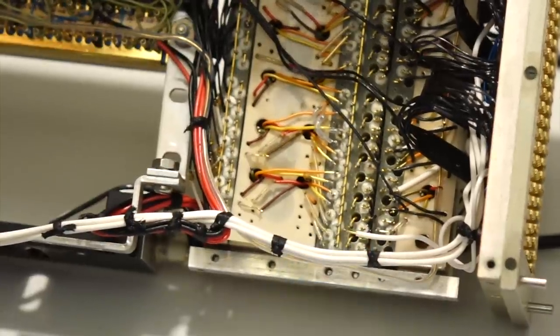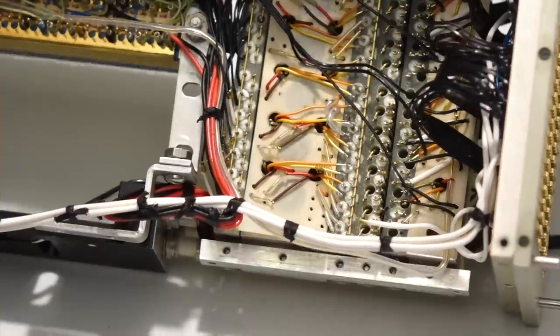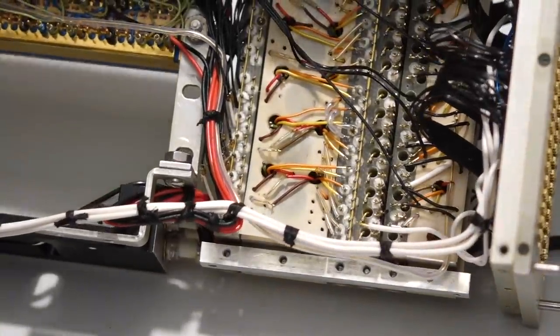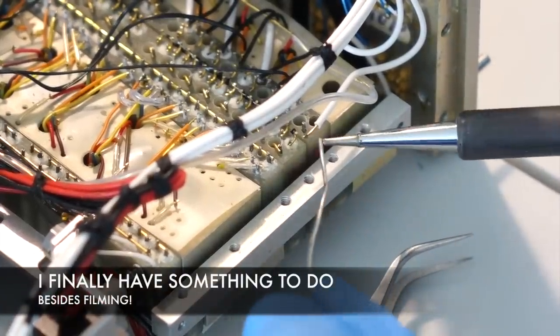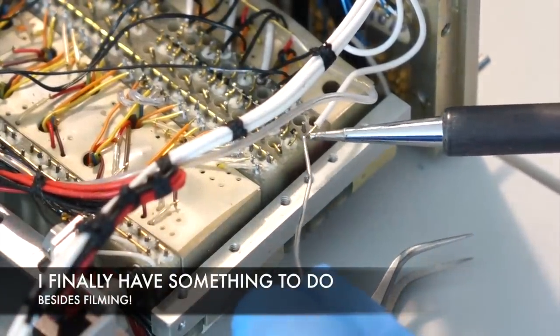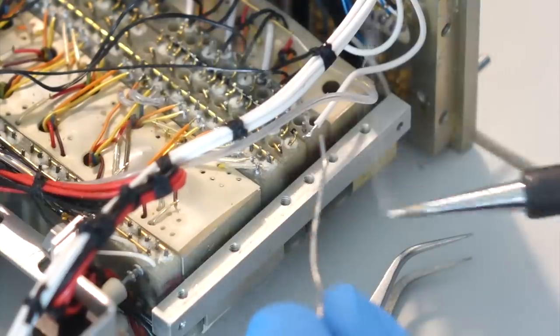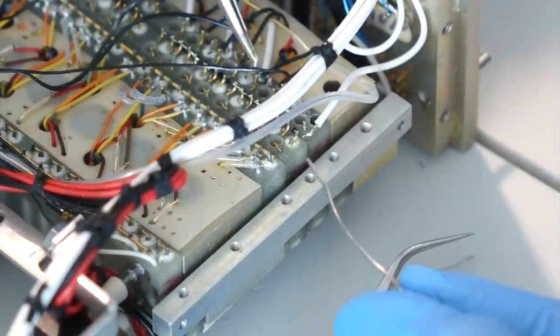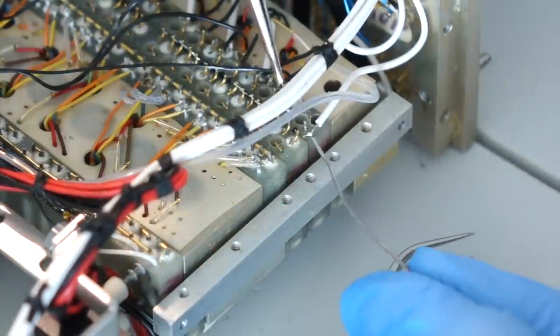Is that also welded construction? Or is that solder construction? I believe it's welded construction. So conservatively, say it's 20 gauge. So 20 gauge, you can put 11 amps through it for chassis wiring. Oh yeah, it's 1.5 amps for power transmission. So we just need a pair. It's solderable pair wire, so we're good.